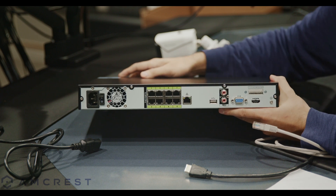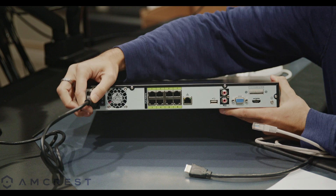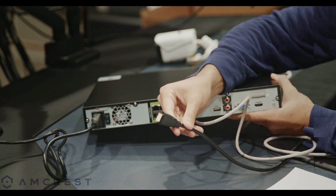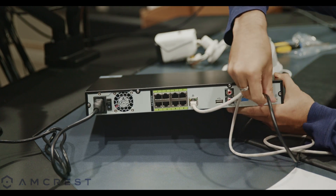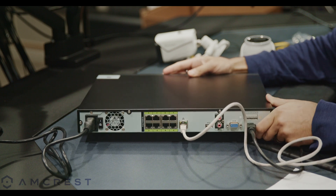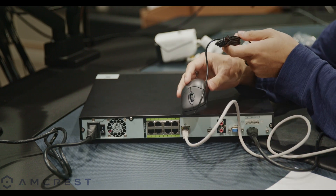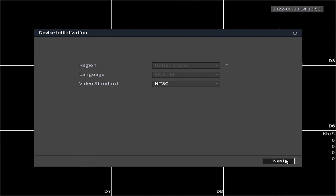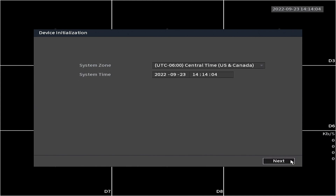Let's begin setting up our NVR. Plug the power cord to the back of the NVR. Next connect the Ethernet cable to the Ethernet port on the back of the NVR, and the HDMI cable will go into the HDMI port and to the monitor. If the NVR has a power switch, make sure it's flipped up to turn on the NVR and allow it to initialize. A USB mouse is included with the NVR to interact with the monitor, however any USB mouse can work. With the NVR turned on, it will bring you to a device initialization screen, a startup wizard, and the registration menu. Verify the region, language, and video standard are correct and click next to continue.